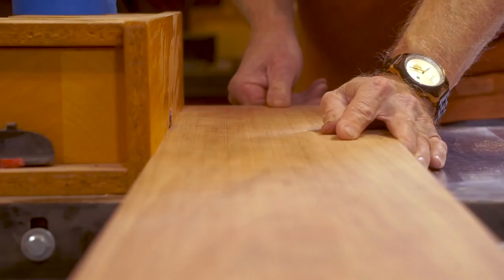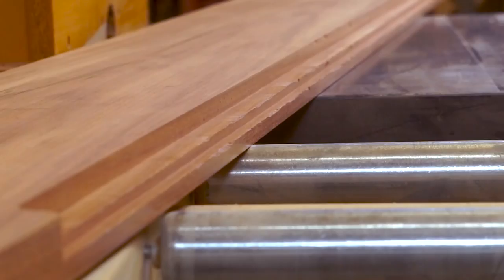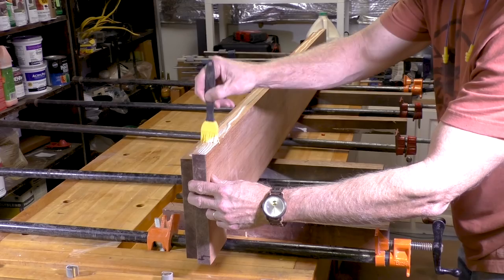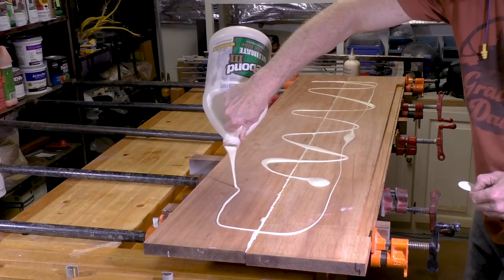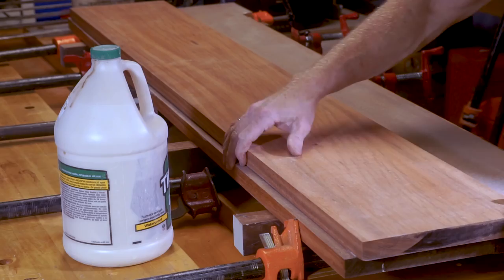Now I'm moving the fence away one more time for the third and final pass. I didn't have to be very precise with my router positioning because I'm going to custom fit the strip of wood that's going to fit into this slot, so I'm just measuring the dimensions now to cut a strip to fit. I probably could have used biscuit joints to help align everything, but it didn't seem necessary because this wood was really nice and flat and the clamps were going to press everything into alignment anyway. Gonzalo Alves, or Tiger Wood, comes from Central and South America and it's a very hard wood. To put it in perspective, Tiger Maple has a Janka hardness rating of about 1,400 to 1,500, while Tiger Wood has a Janka hardness rating of 2,100.